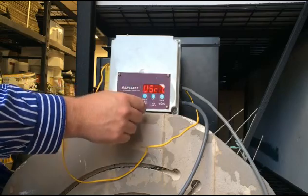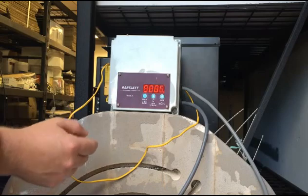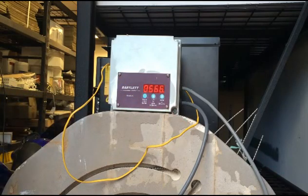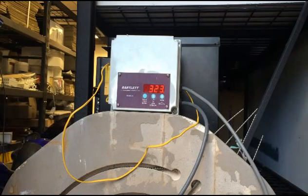If you'd like to kick it off again, press enter. It'll display User 1. You can do a review: six segments — first at 139°C/hr up to 566°C, holding for 30 minutes; up at 139°C/hr to 677°C, hold for 20; up at 167°C/hr to 795°C, holding for 20; ramping down at full speed to 510°C, holding for an hour; ramping down at 111°C/hr to 427°C, holding for 10 minutes; ramping at 167°C/hr down to 35 degrees, holding for none because it's done. Press enter and the firing schedule starts.